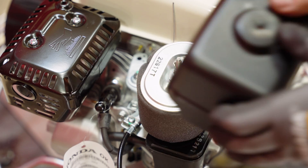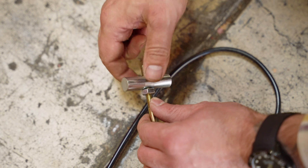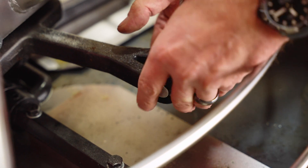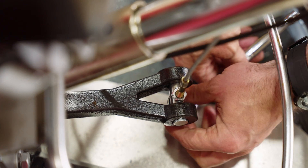Finally, replace the air filter and cover. To connect the blade pitch cable, remove the nut from the pin using a 13mm wrench. Insert the blade pitch cable end through the yoke eyelet and tighten the top and bottom nuts to remove all slack from the cable.